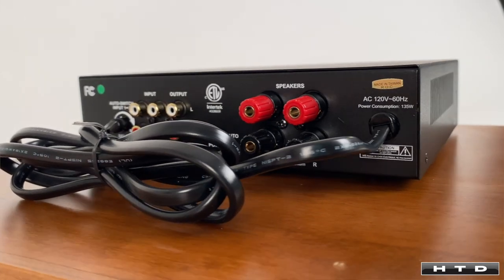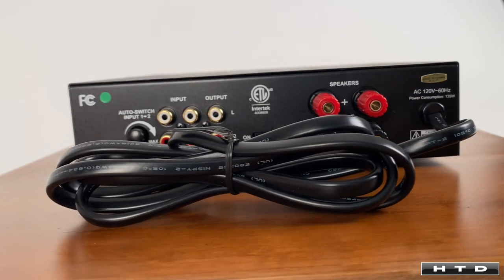In that type of application you can take the audio from your television and plug that source into the amplifier, and then you can plug something in like an Echo Dot into the override. This way if you're watching television you can ask Alexa a question and the television audio will be temporarily muted while Alexa responds. Once she is done it will automatically switch back to the television audio.